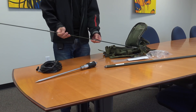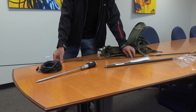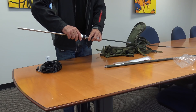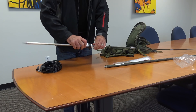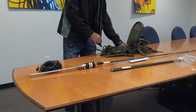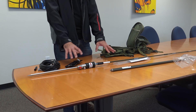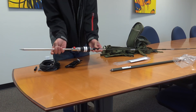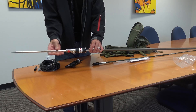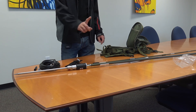I'll show you outside when we have more room. This little vertical here by itself can be used as a man-packed portable. So let's say you want this thing on the transformer — you throw your tail wire, which comes with it. That would be your first option for a man-packed portable, 26 through 54 megahertz. Counterpoise wire, 25 feet of it with ring terminals, would go on the red post and you lay that out. Or we can go outside because it'll be too long for the room here — we could attach it to the extension and put the little whip on top of the extension. Now you'll have like an 18-foot vertical with the tail wire, and you could have all bands with a tuner.